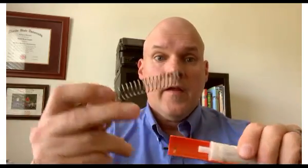To help you understand what makes our cleaner special, I cut away part of the handle so you can see the internal components. We have a spring in here that drives the turn drive shaft, and this is the helical gear system — the thing that drives how much cleaning strand is dispensed with each engagement. The spring causes the push to drive the cleaner, and as the cleaner is engaged it comes in and back out, so the length of that gear determines how much cleaning strand you get.